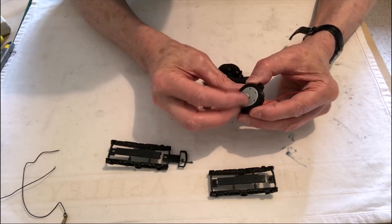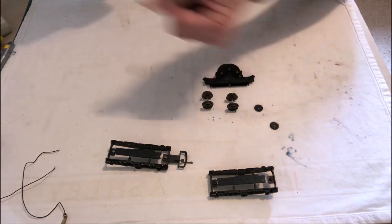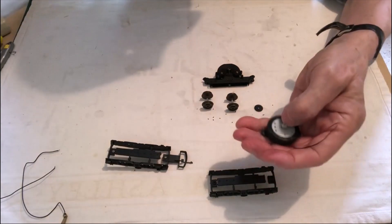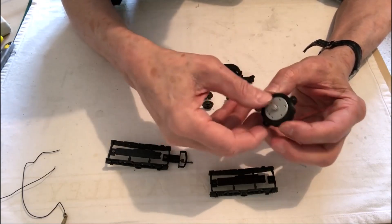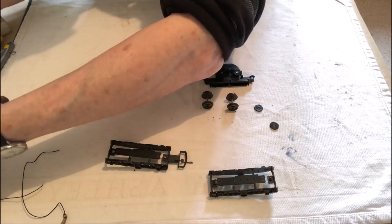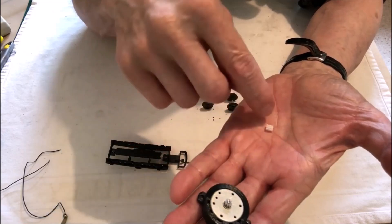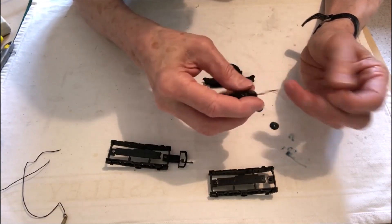Now there's a wee little cog that goes on here to replace the one fitted on the original armature. You'll see there's a little drive cog on the end of the armature shaft — we've fitted a new one onto this motor. They come with the motor in some cases depending on who you get it from; if you get one that's not fitted, it's quite possible the little cog will be too long. Push it on and then trim it off, because if it's too long this won't fit in the motor housing.